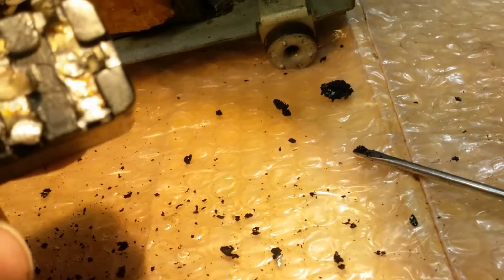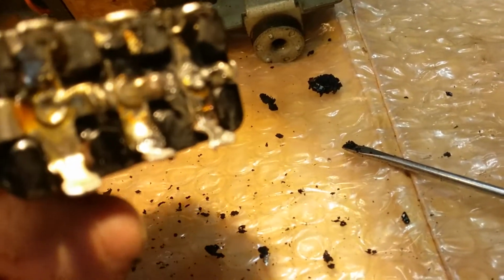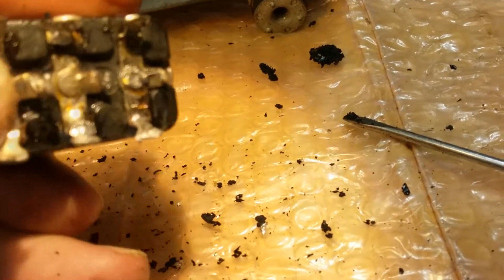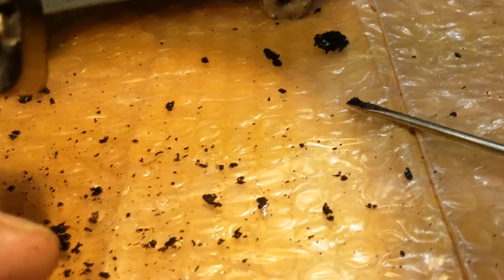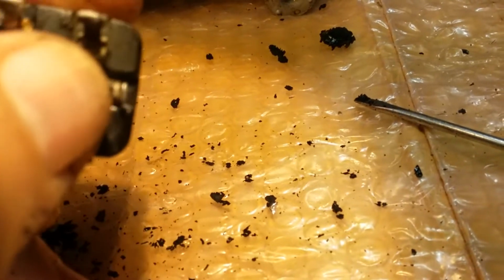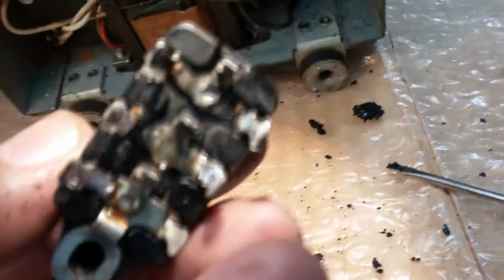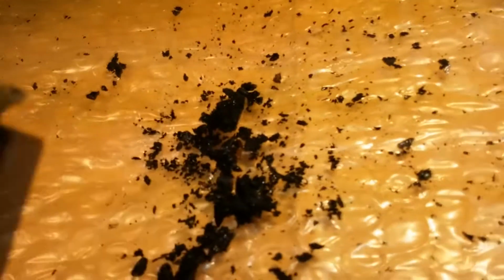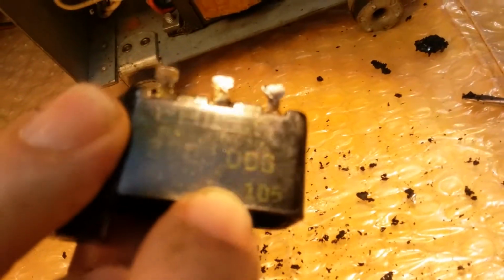And then you just unsolder the wires. They come through. You see the wire coming through. This hole here connects to that center pin. The other two, one comes through here and connects there, one connects there. And they're the same value, usually like 0.01 microfarad. So you can put the new caps right in the case, and then it gets screwed back on like that, back onto the radio, and no one ever knows that it's been changed, and it's still got the original Philco information written on it.